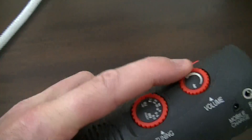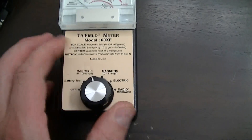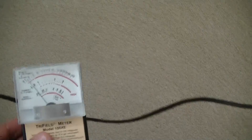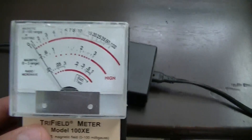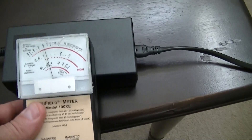So we're done with our AM radio test. Let's go to the next meter. I'm going to start on magnetic field. While it's all in standby, let's see what's going on. We're on the 0–100 magnetic range. We're not really picking up much until we get to the power supply, which has a field of about a foot around it.